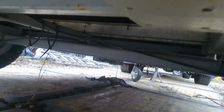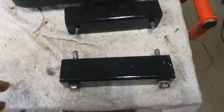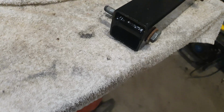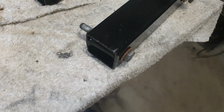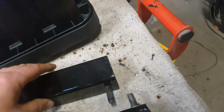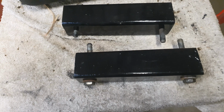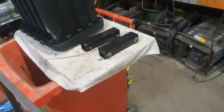I've made it myself. Right, we'll go back in and I'll show you. So these are spacer blocks that I've made. It's just some box section basically. Drill some holes. I'll put some crush tubes, tack welds of those in the middle. I probably don't need them, but belt and braces and all that. So I've got 2 of them. I believe it's 50mm box. So that'll give me roughly 2-inch lift. And then the trailer should sit level with the Land Rover then.